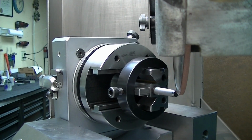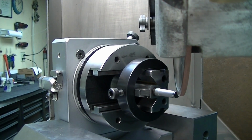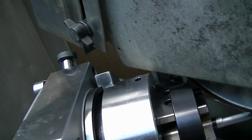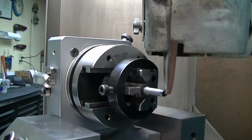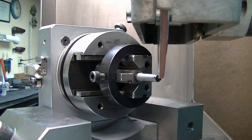Lining the wheel up on the existing cutter. Existing cutter is really handy for coming back and getting your setups real close. And you can see here that clearance-wise, you can see why I'm talking about 8-inch wheels being a better choice, but I'm going to make it here. But only because that wheel was spaced out, like I mentioned in tool room tips number 2.